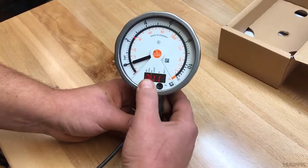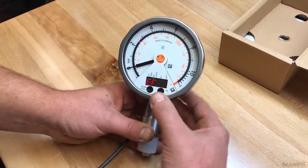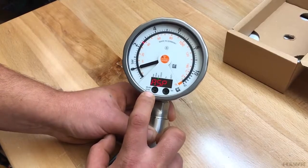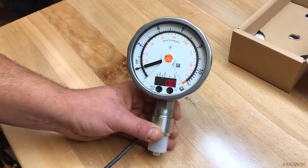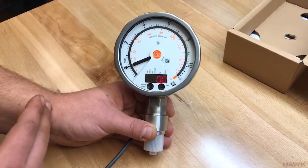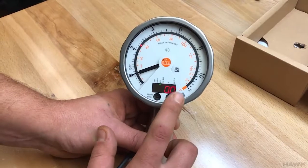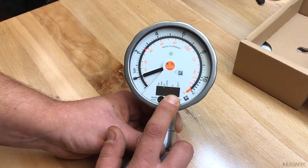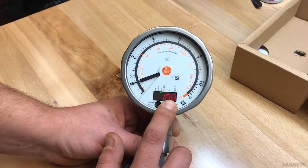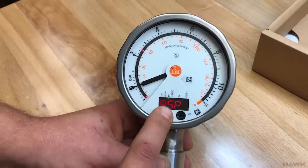This is also found in the extended function menu. The analog start point is the value you consider the bottom of the tank, or the 4 milliamp output of the 4–20 milliamp signal — this is the low end. Sometimes it will be zero, but if it's on an elevated tank, this pressure corresponds to the top of the stand pipe, which is the bottom of the bowl, so this may be some non-zero value. Press and hold set to change this value. This value is in the units the gauge is set at — right now in PSI. Say the bottom of our range is 40 PSI, so we set that.